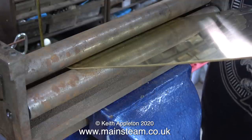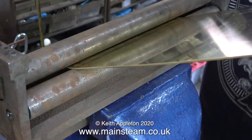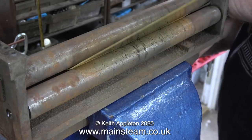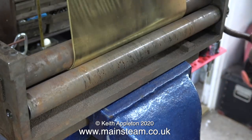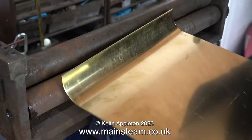This job is actually quite tricky — more difficult than it looks. I've had to be very careful to put the piece of brass sheet into the rollers perfectly square. I tighten down the top roller against the brass — not too tight; generally speaking one turn of the Allen bolts that adjust the top roller will be sufficient for each pass. Then by rotating the handle I move the brass sheet back and forth until it's bent. I need the bend at 90 degrees to the main plate, so it's very important not to over-bend — if I carry on it will just end up as a thin tube.